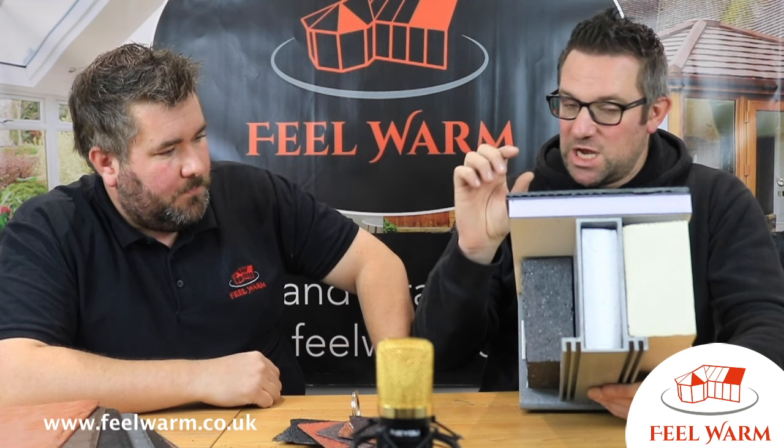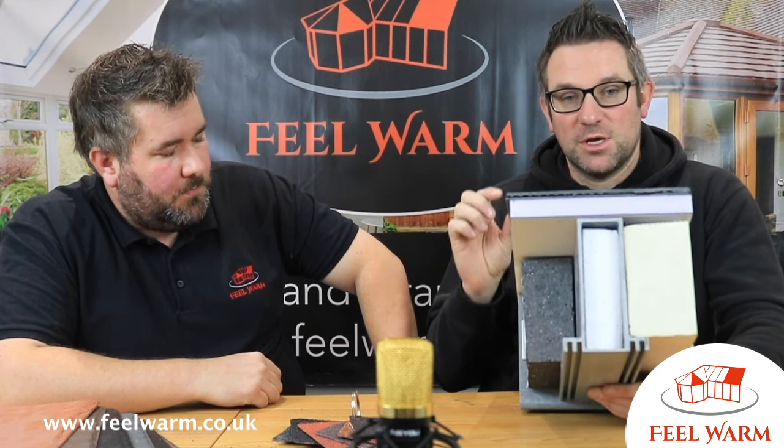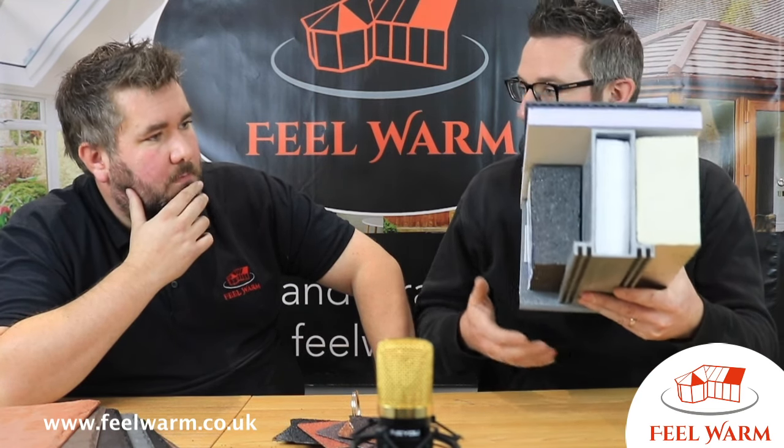Absolutely not. We'll go into timber a bit more later, but when you're putting timber onto UPVC, it's not the greatest thing in the world, because you get two different materials that expand and contract at different rates. So it causes movement, possibly cracking in your frame welds, a crack in your plasterboard, things like that. And you imagine you've got your frame already and then you're raising your roof, creating a lot more rocking on your frame because you're trying to push it up with a big beam.